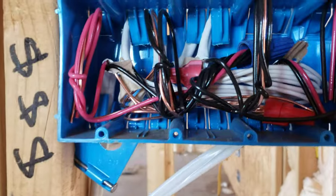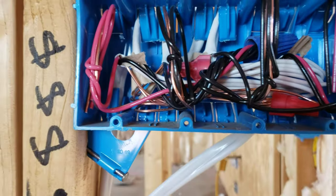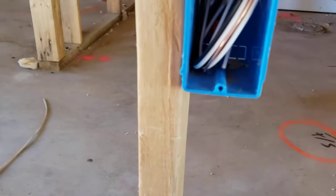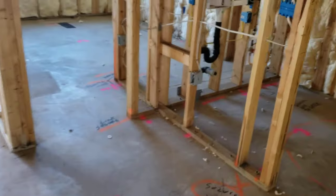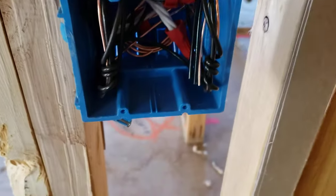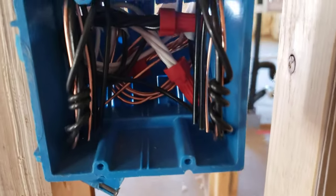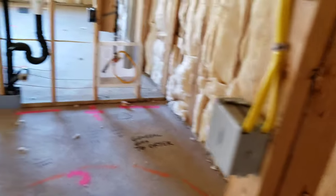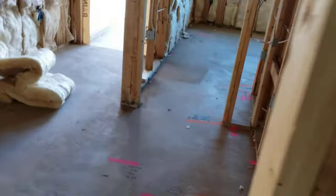You can see at the point of that wire it's actually aluminum at the core. It's over 90% aluminum on the inside, and the copper was just added to the exterior of the aluminum to give the wire better performance. This is not a new concept — it was used in the 1970s for a short period of time after they had issues with aluminum branch wiring. It's called copper clad aluminum, or abbreviated CCA.